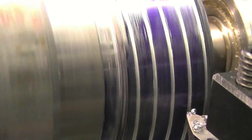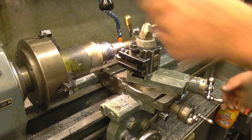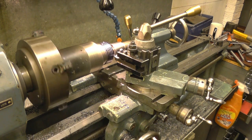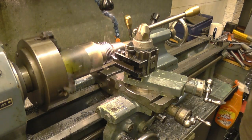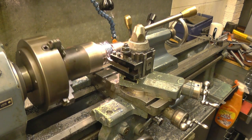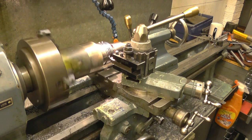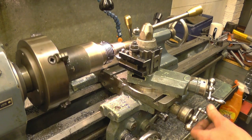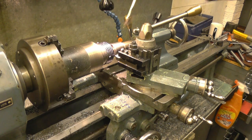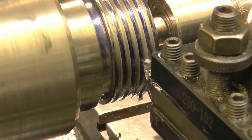Once you get into the procedure, you've got to keep to it — keep doing things the same way. It's very easy to make a mistake and we don't want any double start threads. Winding 100 thou, that's back to where we started from. A little bit of cut, cutting oil. Run the lathe forwards — see how slow I can make it go. If it was a long thread I would use the thread indicator and disengage the feed nuts, but it's not, so I'm going to do it this way. Out one full turn, then back into zero again. A little bit of cut — you can see it's only cutting on the front half of the tool.